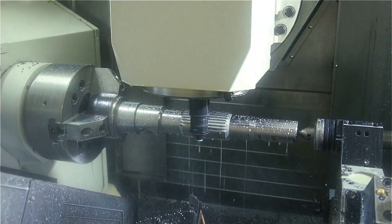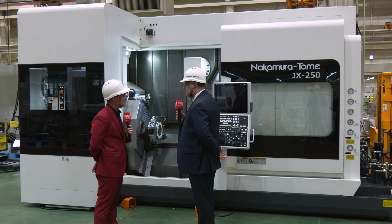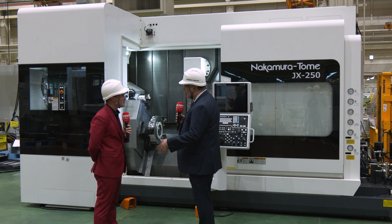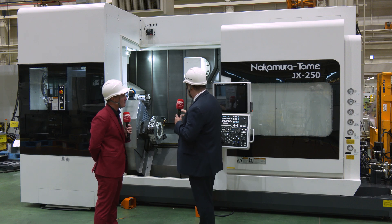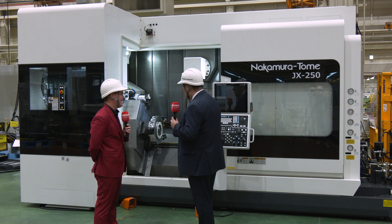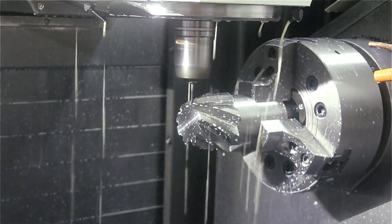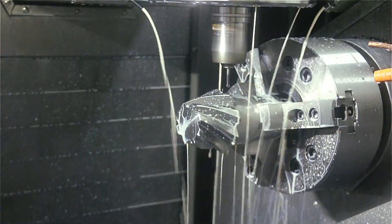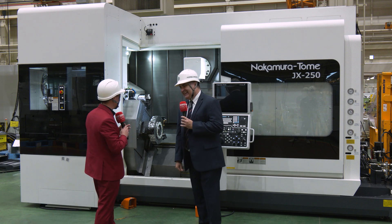We are truly able to rotate this smart cube and still maintain the cutting process because of its compact size — and you're not losing rigidity, torque, or horsepower. There's a lot of new servo technology that comes with this. Even though you look at the size of that spindle, it's still a 25-horsepower spindle. The motors are smaller but more powerful, and the mass behind that spindle is significant — this machine is 55,000 pounds. Very heavy-duty construction, very stable — it's not only the rigidity of the spindle itself but the rigidity of the overall machine.